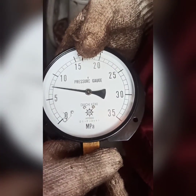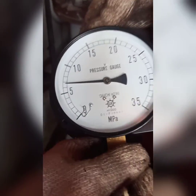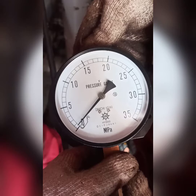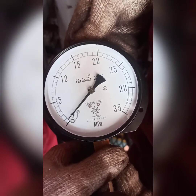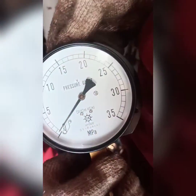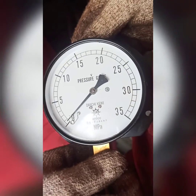For that, we have to see what the operator is doing when he is hoisting up the grab load in loaded condition. Then we note the pressure and compare it with the manual and also with previous readings. You will always see a fluctuating reading, so we take an average. For example, if it is between 90 and 110, we take an average of 100.